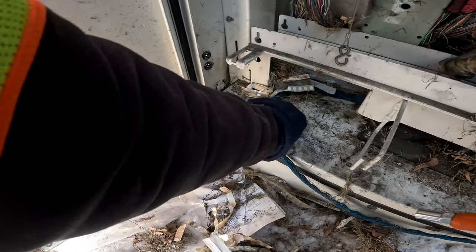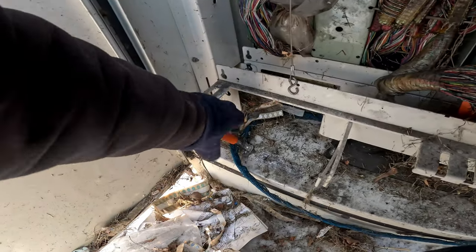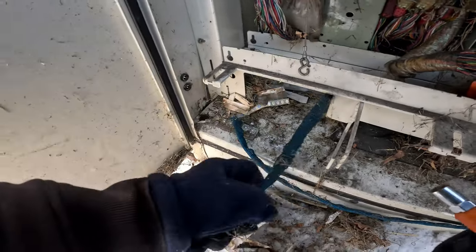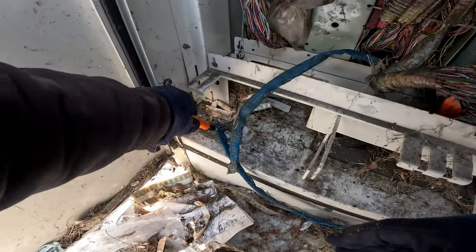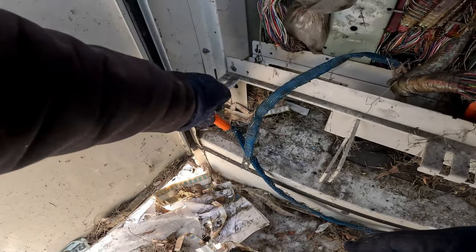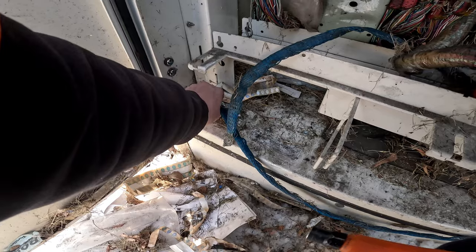One. Don't lose the nut. Need a nut. There's 2. And there's already 3 bonds here. Supposed to be 2 more missing. So you know what that's telling me, folks? 2 of these cables ain't bonded. There's only 3 here. Supposed to have, what I say? 5, I think.